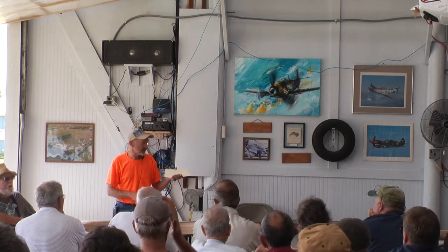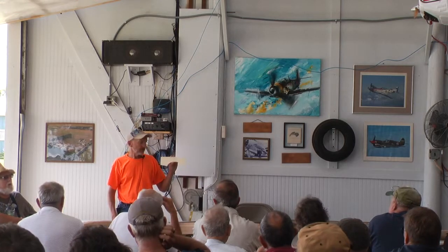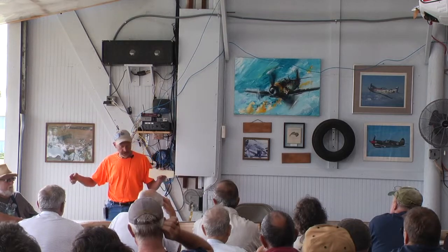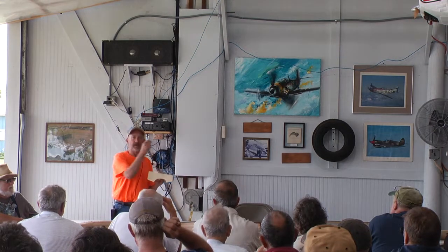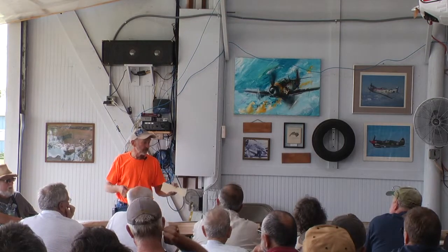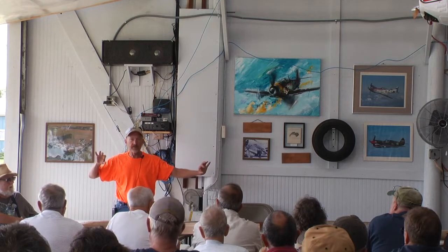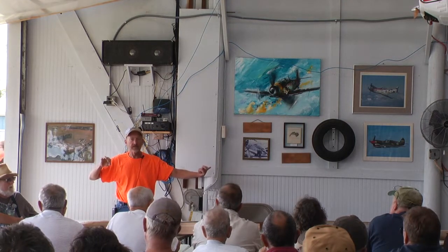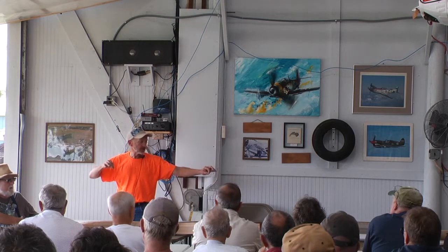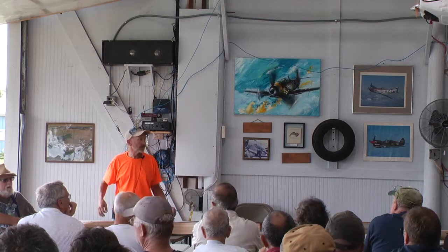The gentleman says that the glue lines are really, really good information, because the position of the glue line on one side has to exactly correspond to the position of the glue line on the other side. From that, you can pretty much surmise that you're in the exact right spot. You've taken off the exact same amount of material on both sides if the position of that glue line is in the exact same spot on both sides.